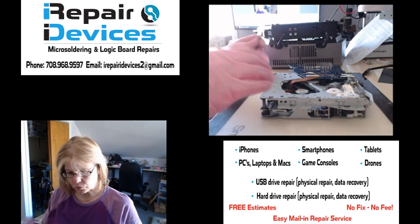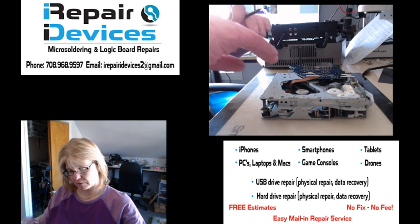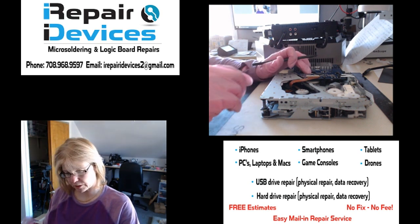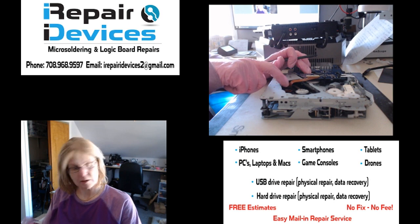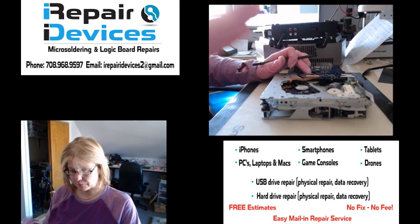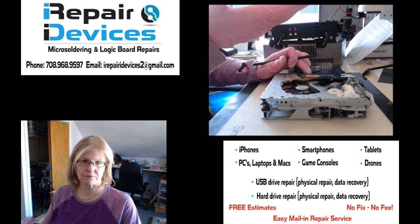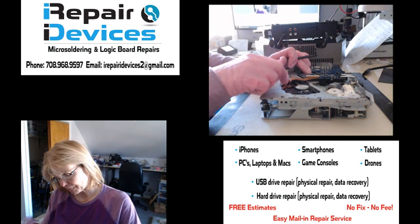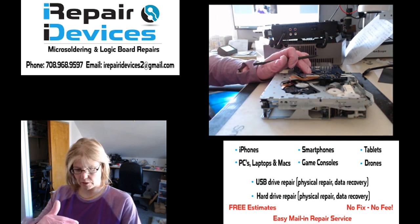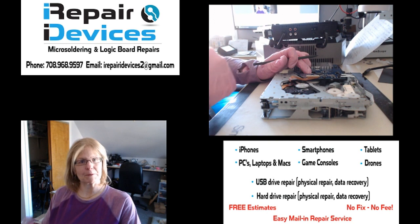So what I'm going to do is manually test this. I'm looking for visual feedback — I want to see how this assembly is raising and lowering. I'm going to press down the clutch here, which engages it, and just rotate this one gear. Because it's flipped upside down, I'm actually lowering it to the lowest spot — down to drive slot four. Then I'm going to rotate the gear to the top, and what I'm looking for is whether all the worm gears meet up at the top at once. I'm keeping an eye on the left, the center, and the right.